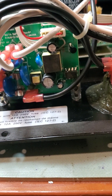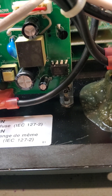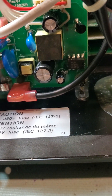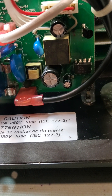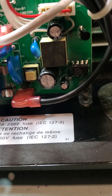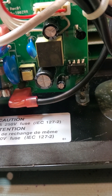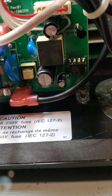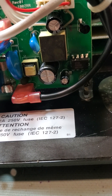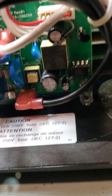In my case, I wasn't getting six volts — I was getting something around 1.7 volts, so I knew something was going on. I tried to look at all the caps on the circuit board and they all checked out okay, so I didn't suspect any problems there. In my pursuit of getting this thing to work, I ended up bypassing this and hooking up my own six-volt supply, and when I did so it seemed to work okay.